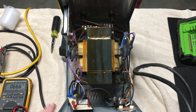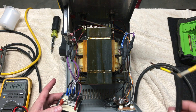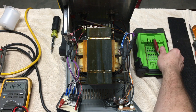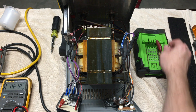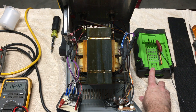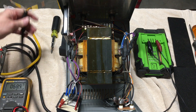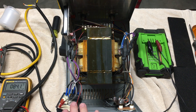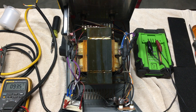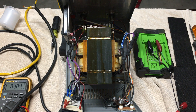The reason we're not getting output right now, even with 120 volts coming in, is that this board is looking to confirm a battery is connected before it allows output. Since I don't have a golf cart here, I'm going to use an Ego 56-volt battery that I'm in the process of repairing — it has a bad cell but it puts out roughly 48 volts, which we can use just to signal the relay and get 120 volts to the transformer. Checking the battery, it reads almost exactly 48 volts, so it'll be a good test.